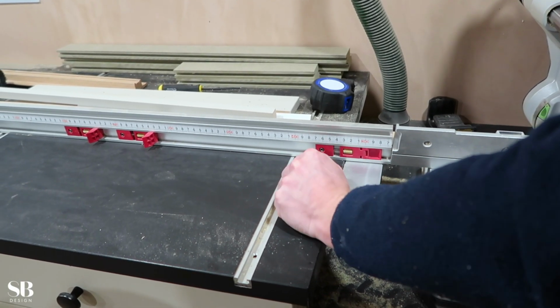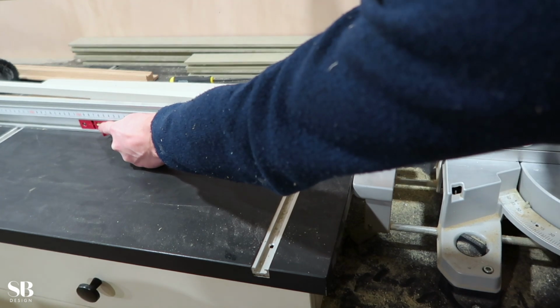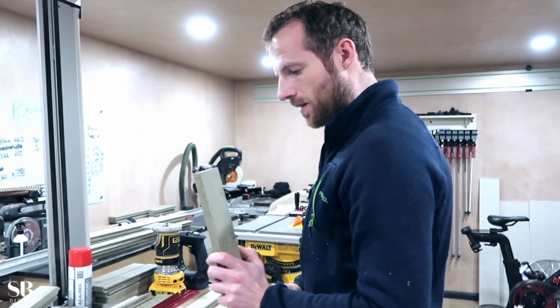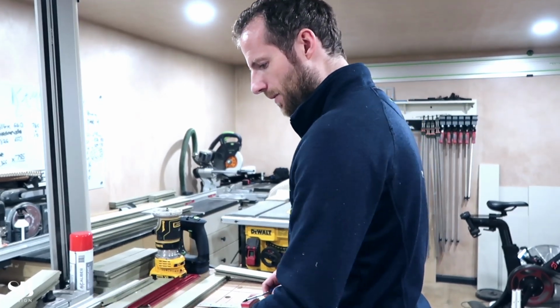that we're doing. The right hand side and left hand side of the chimney breasts are slightly different sizes. So this is the setup for the right hand side, and then this is the one on the left hand side as well for the slightly longer one. So we've already cut the stiles. The stiles is the vertical piece on a shaker door or drawer. So they're already cut, already grooved as I said before, so they are now pretty much done.